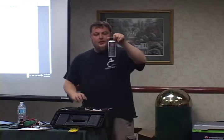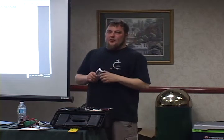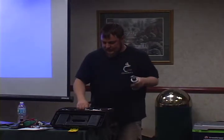Contact cleaner. That's saved my life a few times. There are times where you fix the entire player, you check everything, nothing's wrong, picture's still fuzzy. Something's wrong. There's the 3 and 4 switch on the back of the players. Make sure the player's off and unplugged, but spray that in there and work it in. All of a sudden, the picture's great. Are you serious? That's all this was? That's beautiful.